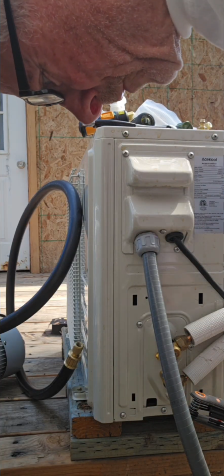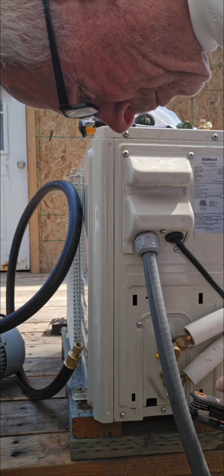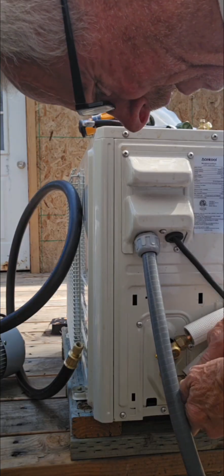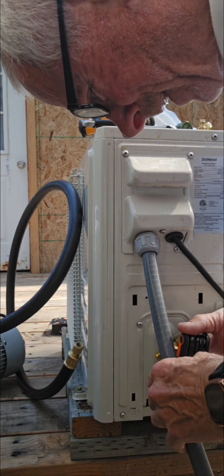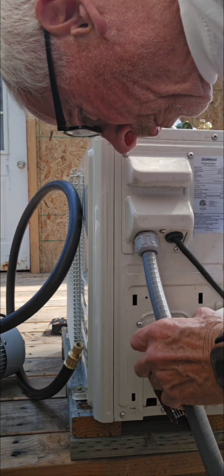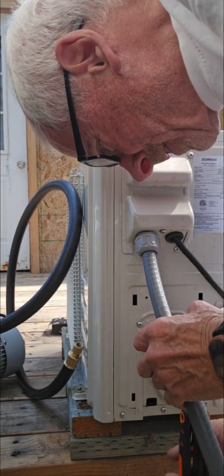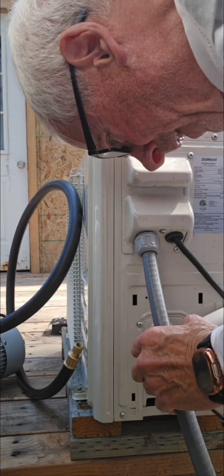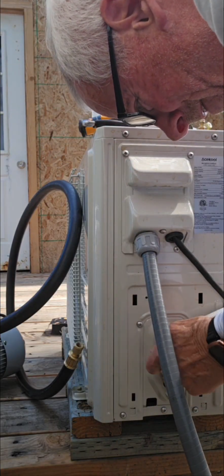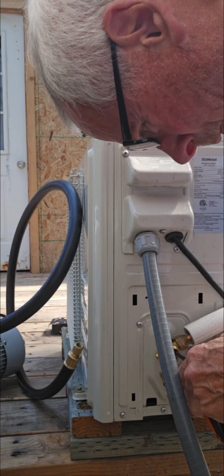Now we're going to release our refrigerant into the system. So everything's done. Our valve core tested perfect, and it was simple as that. Now we'll simply open up the refrigerant, and again, with the side that's not connected to where the tool was. So we do that one first, and there's a little stop right there, and it stops you from going any further. So you just go right up to the stop.